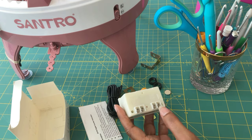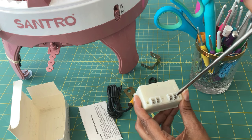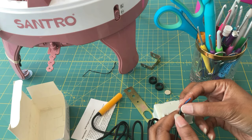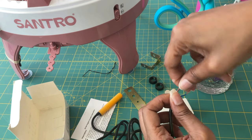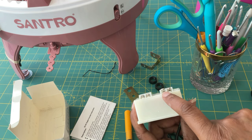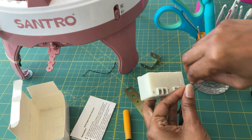When you're looking at the back of this counter, one side says reset and one side says count. We're going to be loosening the screws that are to the right — above the screws it says the word count. The two copper wires you're going to be connecting have a red and a blue side, and it actually doesn't matter which side goes where, as long as they're both on the right-hand side of the back of the counter where it says count. Can you see right here where I loosen the screw? There's a space between the screw and the back of the counter — that is where you want to stick your copper wires.